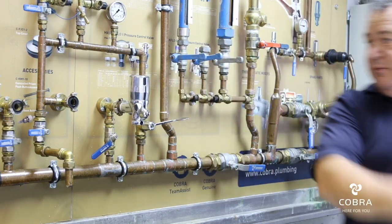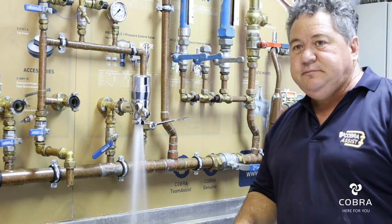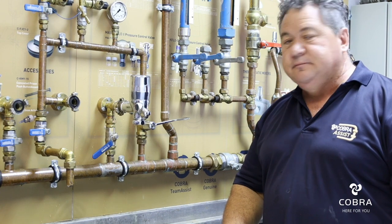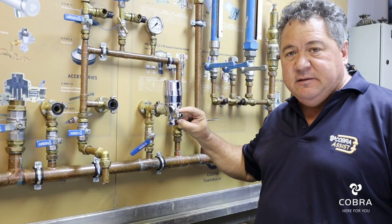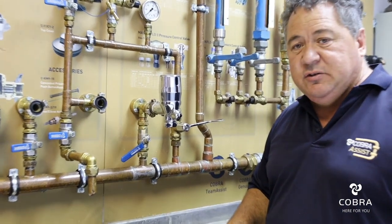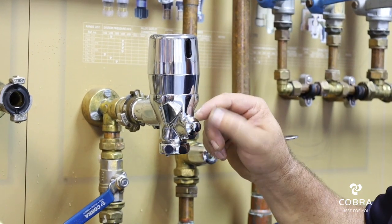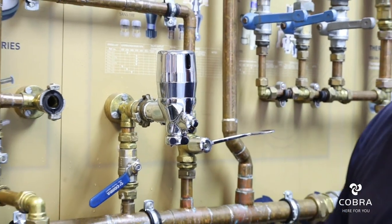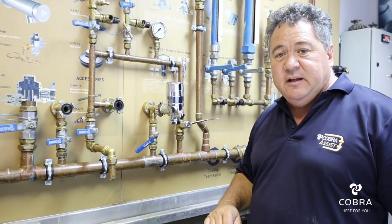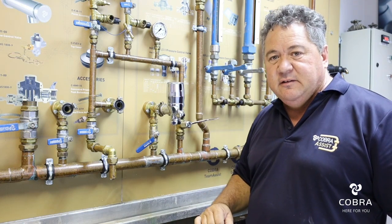As you walk away, it will give you some time to walk away and then it will flush. That is the complete installation. Guys, we are specifically leaving the button because it's human nature to flush the valve after using it. We've seen that guys actually press the infrared sensor if there's nothing to press. So this is just there for if there's a need to press something, press the button — don't press the infrared sensor, and we've seen it works.